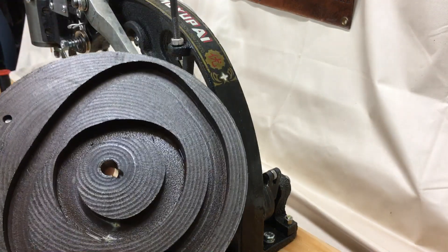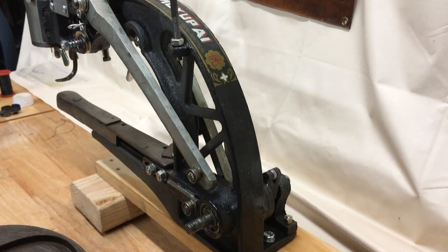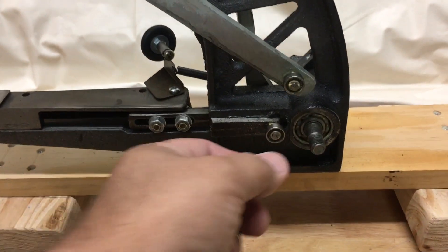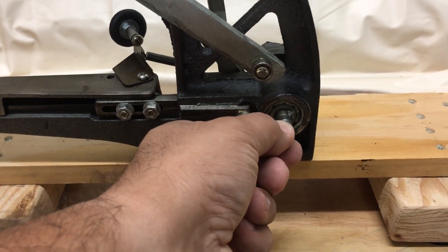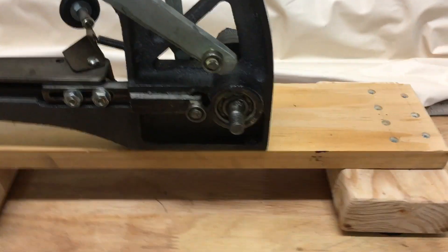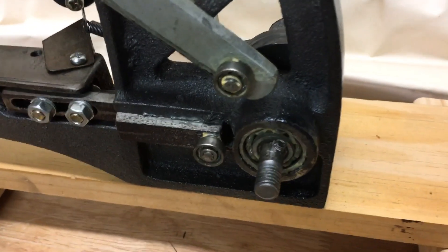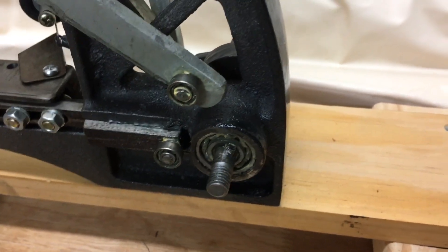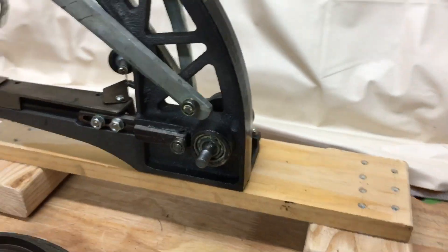Your main wheel has two grooves in it: one in the center and one on the outside, and a cam with a slight indentation. That indentation has to go over this part of it. If I turn the cam on the axle, there's a small screw sticking out, and that is the area that needs to be aligned with the inside of that hand crank.